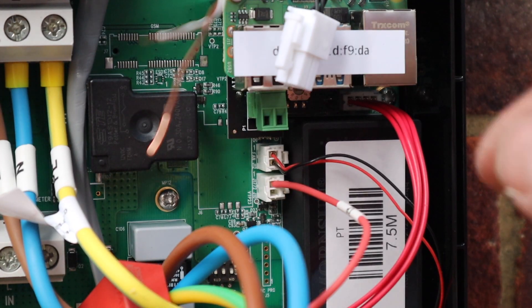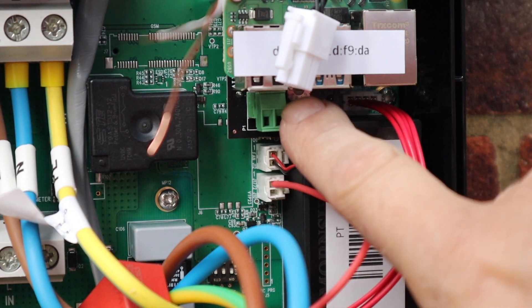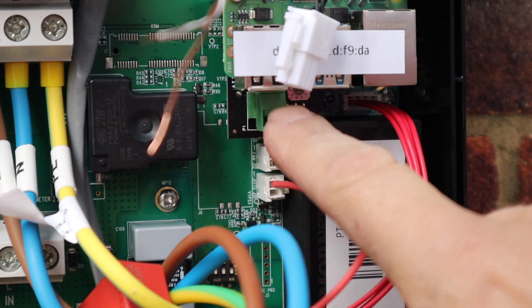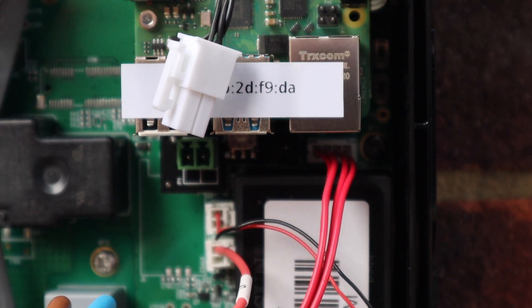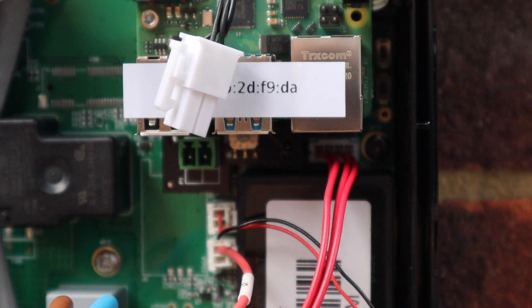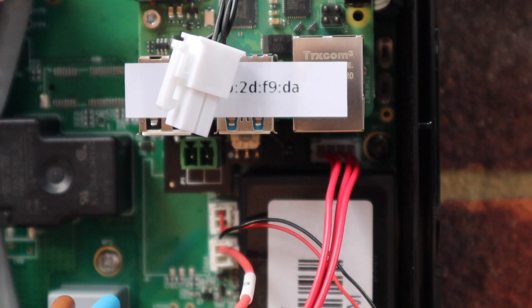I've got the consumer unit installed and the charger mounted on the wall. I'm going to get done with my dead testing. So inside the Hypervolt, we have two terminals here — this is your CT for the dynamic load management. And just behind this here, we have a little dial. You need to adjust that to suit your installation requirements.